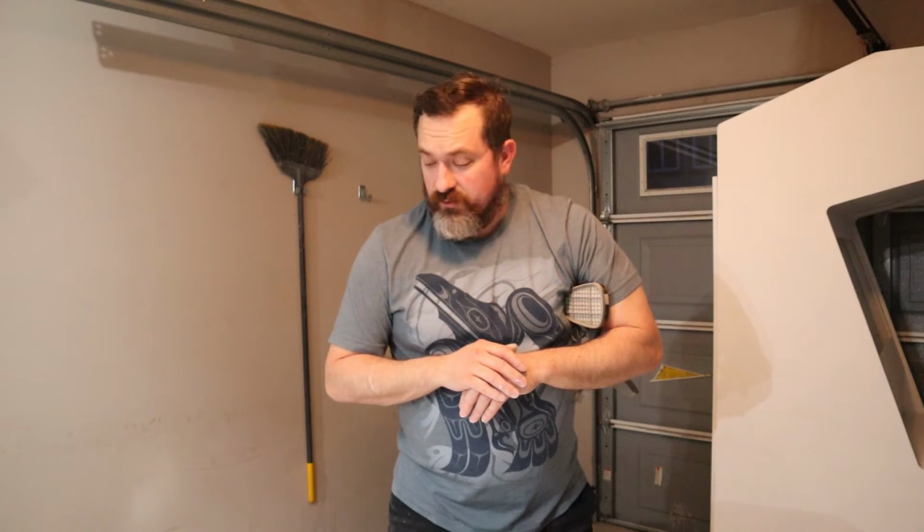That was a crazy amount of work for just 2 coats of primer, but that is it. I'm done with the white primer sealer. Overall, not a bad product. It's pretty good. I could totally see why it'd be a good stain blocker. It covers up everything really quite quickly, especially after the second coat. So this is literally the last stuff. Give it a light little sand, get the fuzzies off, vacuum, and then start doing the top coat and start looking black.